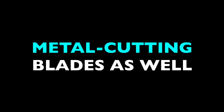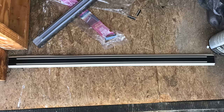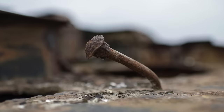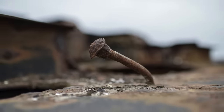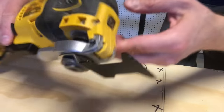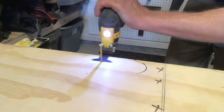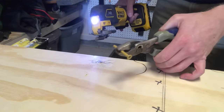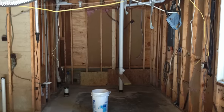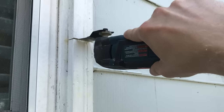On top of that, it can cut metal with metal cutting blades. I've used them to notch out steel wrapped studs for pocket doors, or cut thresholds, weatherstripping, and pipes. It's also great for embedded fasteners, because the multi-tool can also make flush cuts. This is where you cut off protruding material at the base. Because the blade has that offset neck, it can sit basically flush on a flat surface, so you can direct that blade edge right to the base of an obstruction and carefully notch it away. I know plumbers use them all the time to cut PVC and copper pipe. So no more spinning, overpowered tools for these delicate operations — the multi-tool does them all quickly and with amazing control.